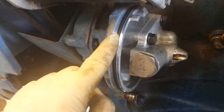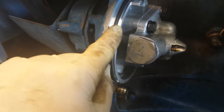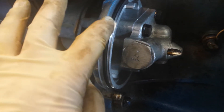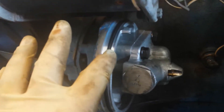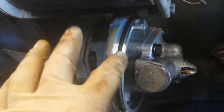One thing to keep in mind with O-rings: whenever you're going back together and you have an O-ring fit like this, you're going to want to make sure you lube the O-ring because if you just slide the housing on, you could roll the O-ring or cut it. If you've never worked on one of these and you don't know how the O-ring is going to react to oil, the best thing to use is vegetable oil. Vegetable oil does not react with rubber — the nitrile in the rubber — it won't cause it to swell. Some oils like motor oil, say diesel 15-40, if you put it on some O-rings it'll actually cause them to swell fast. So if you're not sure how the O-ring is going to react or what it's made out of, go safe and go with vegetable oil.